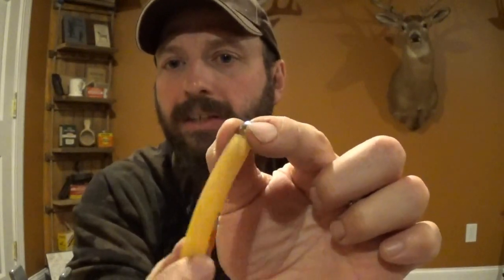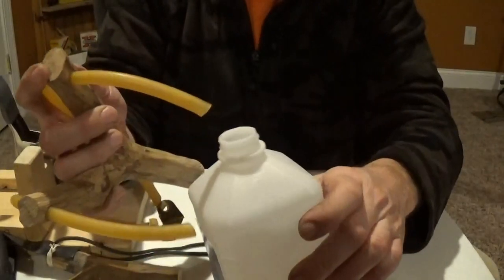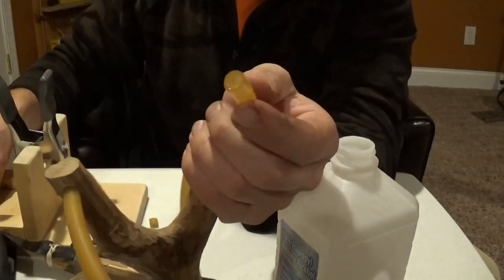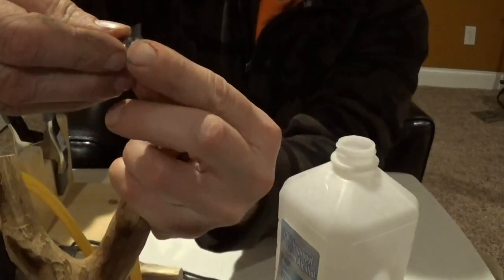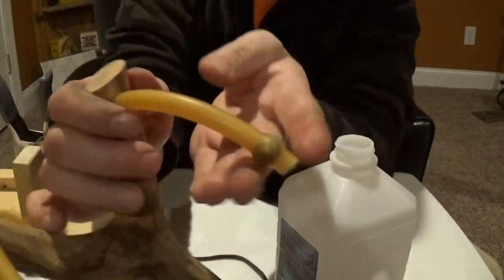Here's one of the tricky parts of this — we're trying to get a 7/16 steel ball into a quarter inch ID rubber tube. To do that, we're going to lubricate it with rubbing alcohol. This is just simple rubbing alcohol. If you didn't have this in the field, spit would work also — this is just a whole lot less gross. With the lubricated rubber tube, I'm able to push the ball bearing into the tube pretty easily.